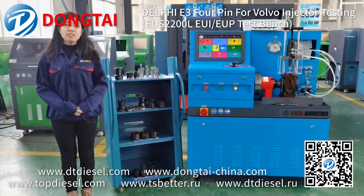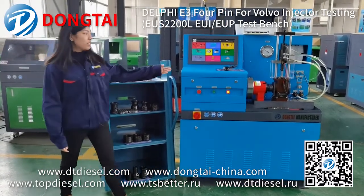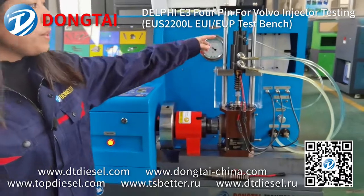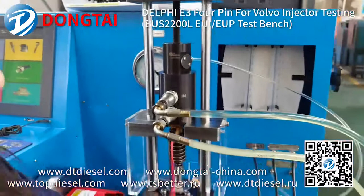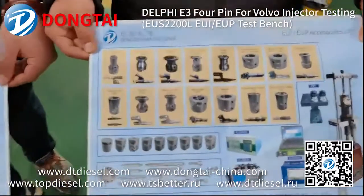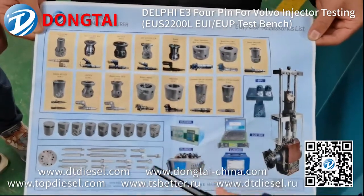Next, our engineer will show you the test procedure of Delphi E3 4 pins injector for Volvo. It is our new model of cam box. We can also add BIP function on this cam box, and it has two separate solenoid valves for this 4 pins injector. This is our new model cam box. These are the adapters, collectors, and pushing rod.